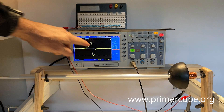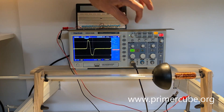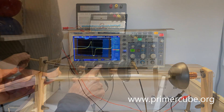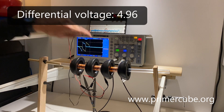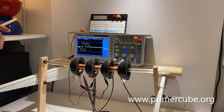When the bowl is right up next to the coil, the output voltage goes down significantly. It also appears that in repeated testing, the magnets shooting through the arrays in this direction are slowing down and would eventually stop if you increase the number of bowls used.